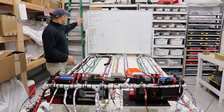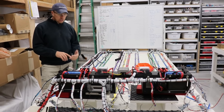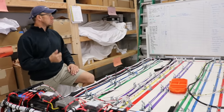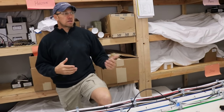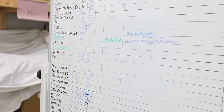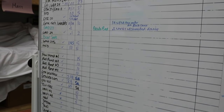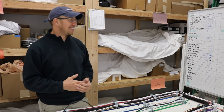The key to our system is laying out the circuits, and we like to really refine it in the sense that we want to detail draw, the circuit breaker value we're going to assign, the size of wire that we're going to run, and any additional notes that we might have, in the case of a Vertical Power, what switches we're going to assign to what circuit as well. This is a pretty good example, actually for a twin turbine project. We have 14 switches in the overhead, and another 14 switches in the lower panel. So pretty switch intensive panel, to say the least.